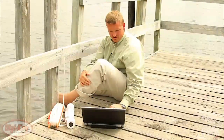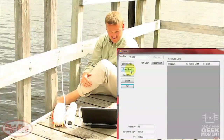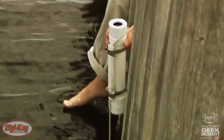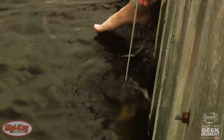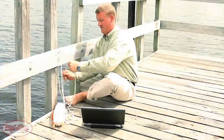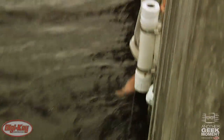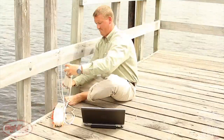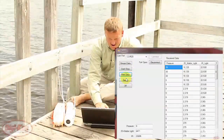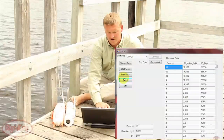That gives a little example, and now we're ready to drop the unit into the water and start recording to the EEPROM. The device has ballast at the bottom and is connected to a rope, allowing it to travel straight down to the bottom and be pulled back up. We've got our data and we'll go ahead and stop recording, print the data out, and export it to Excel for further analysis.